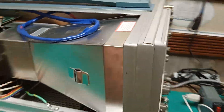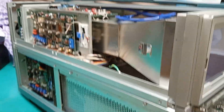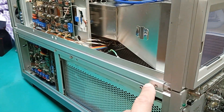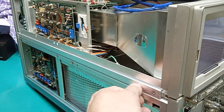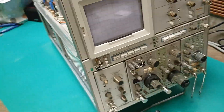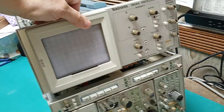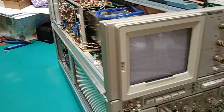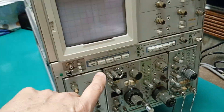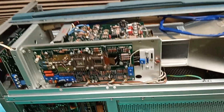The magic trick to getting inside the front of this is taking out screws on the rail on each side, and tipping that rail down. That allows this assembly to be lifted up — that's how we get to the board back in here to replace parts on it.